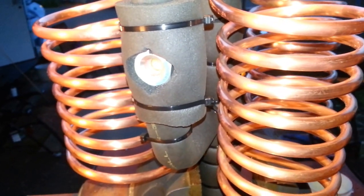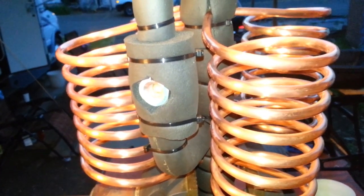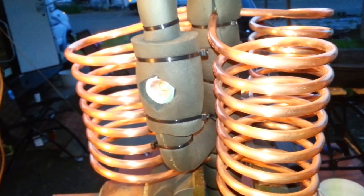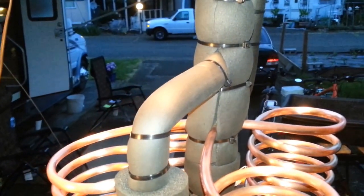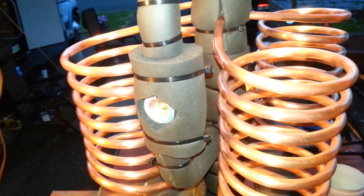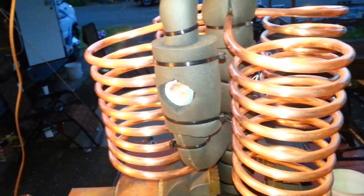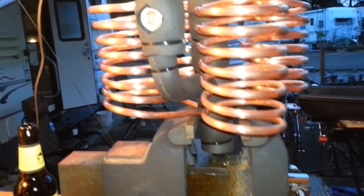The advantage to all this is that the very highest low-side pressure can be maintained, and at all times — assuming the suction line is well insulated — only saturated vapor is returning to the compressor. Very little to no superheat. These units were used for a long time in the 1920s and 1930s in domestic refrigerators. Today they're only used in large commercial applications.